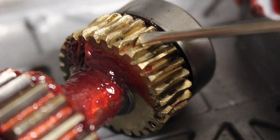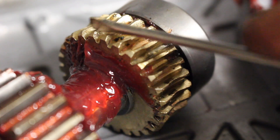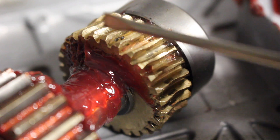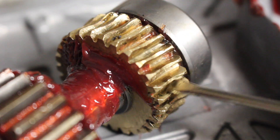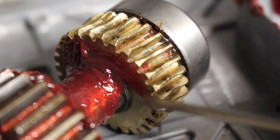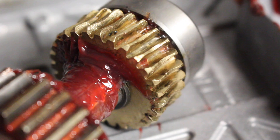We can see that there is a little bit of wear on both sides of each tooth. This concave surface is supposed to be profiled like that, so that's not an issue. The grease does look a bit blacker and dirtier around this area, so there is a little bit of wear, but I don't think that's enough to cause the noise and lack of power that we're having.